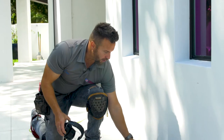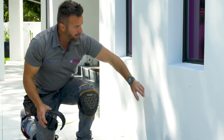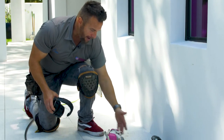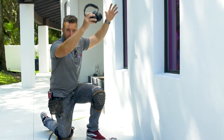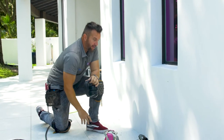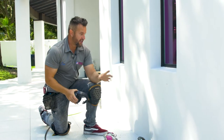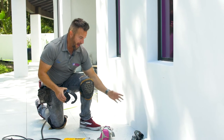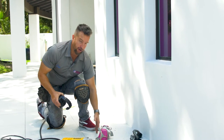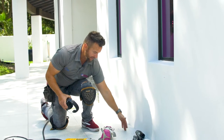If you core drill closer to the wall it's going to be a little bit brighter at the bottom and softer at the top. If you back it off a little bit it's going to be softer all the way up, which is one of my preferred looks — I'd much rather have a softer finish. I've done demonstrations where the stucco wasn't the best job, so you're better off showing the homeowner their house lit up with the lights backed off a little bit instead of blasting it up against it.